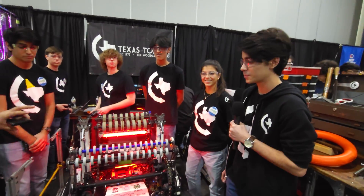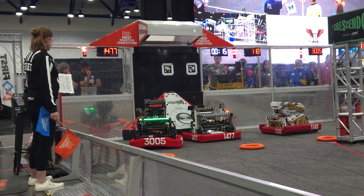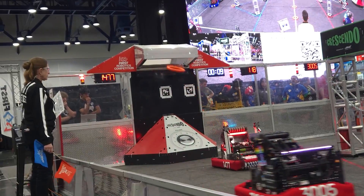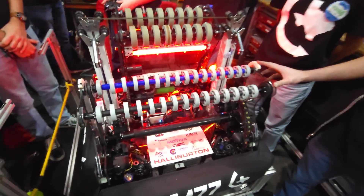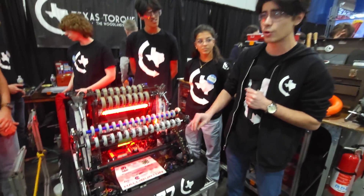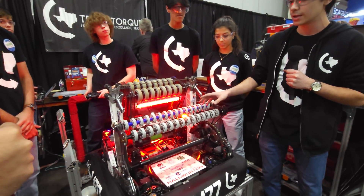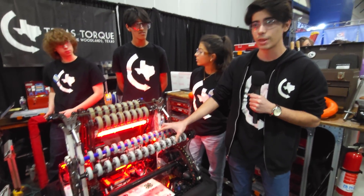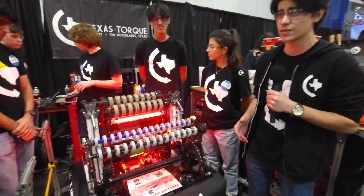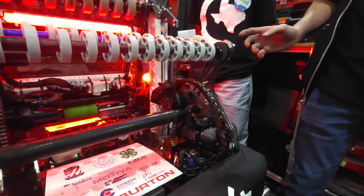John, I want to start off with you talking about your intake. It seems like you guys have an over-the-bumper intake. What was the idea behind that and why did you guys decide to do that? So early on at the beginning of the season, when we found out that we had to intake these notes from the ground, we knew that we wanted to have a full-width intake and have that touch-and-go intake where we'd be able to quickly intake the note and put it in some sort of magazine or shooter system. As we started prototyping, we realized that a front-to-front compliant wheel of rollers were the best way to shoot the note right over a bumper. We also experimented with under-bumper and different styles of intakes, but we realized that with the packaging we wanted to do for this season, an over-the-bumper intake was going to be the best way.